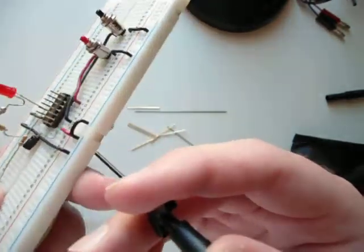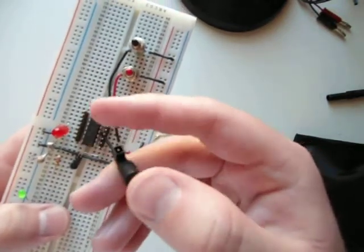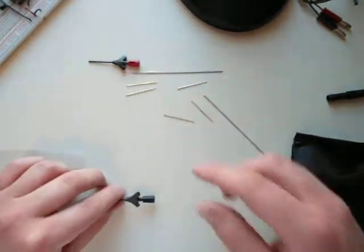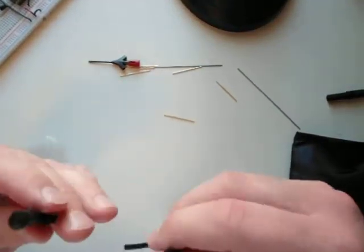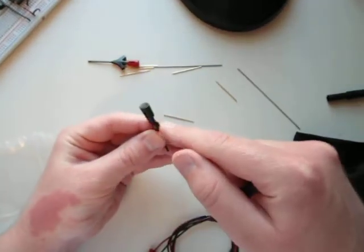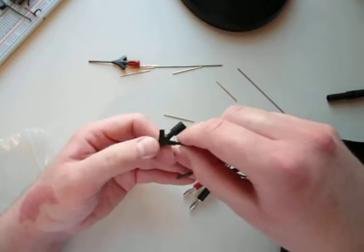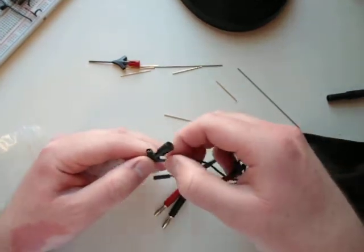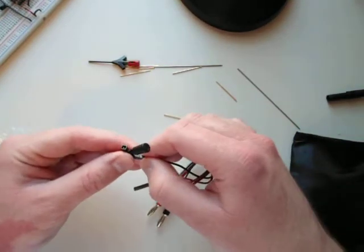Getting in there is kind of clumsy but I'm not exactly a pro at this - I wouldn't recommend trying this out on a live circuit. If we're hooking up these micro grabbers, I'm guessing we'd have to go back to those female DuPont connectors, and sure enough each side of this micro grabber has a 0.1 inch male pin that mates right down in there with those female test leads we looked at before.